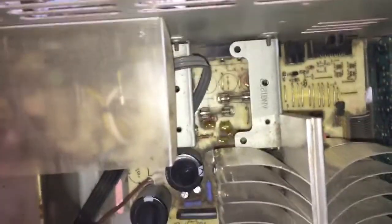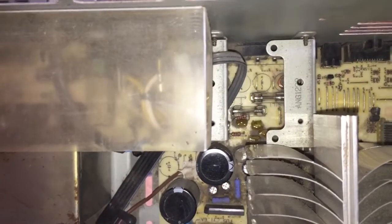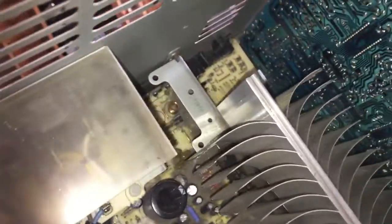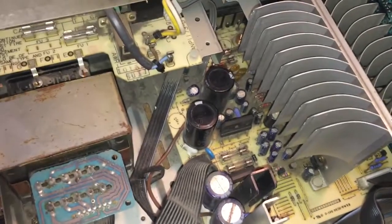Just so you can see — if you do have this again, at the back there FU6 is marked L for left-hand channel and FU7 is for the right-hand channel. Obviously we have your audio output IC with the transistor either side. That was what I was hoping hadn't gone, because obviously it's going to be a lot more expensive to fix than a fuse and much more of a pain in the backside.